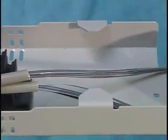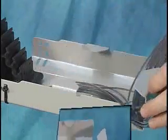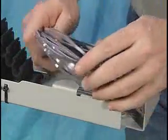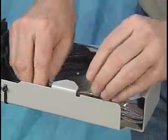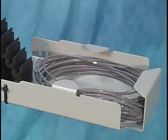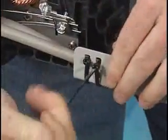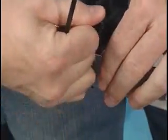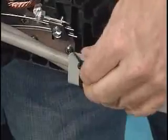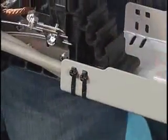Central core tube ribbon cable preparation is very similar to that of loose buffer tube cable. For storing ribbon slack, we recommend the use of the slack storage basket. If no slack storage is present, see the closure installation instructions for further detail. Secure the strength members and core tubes to the sides or bottom of the slack basket with tie wraps. Note that fibers can be routed to the trays using large transportation tube or spiral wrap.